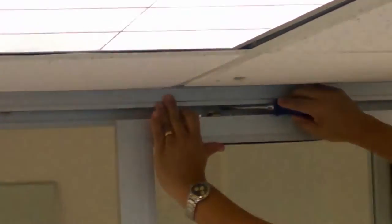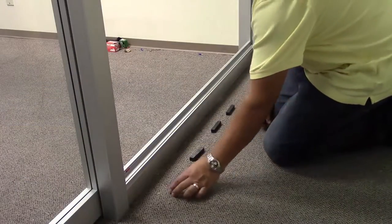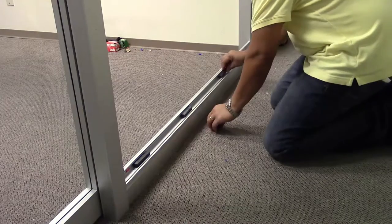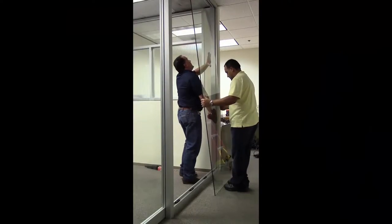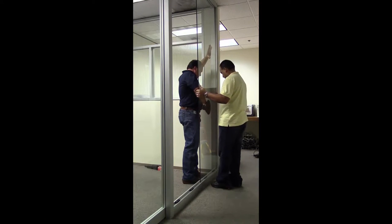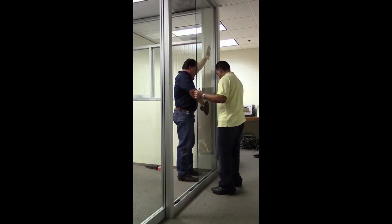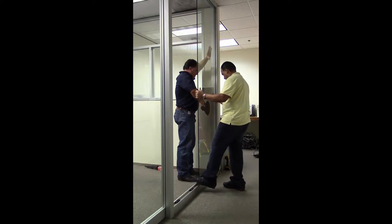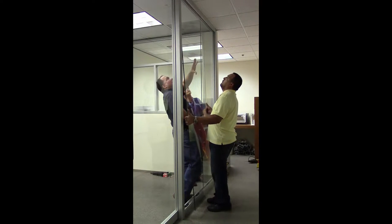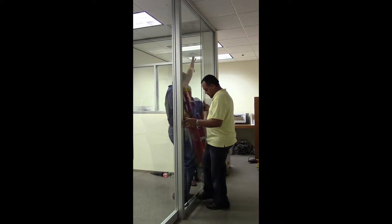The rollers allow you to raise or lower the door slightly with a turn of a wrench. To install the glass at the side light, first place glazing setting blocks on top of the glass base at each corner of the glass panel locations. If a butt glaze condition exists, begin with the panel nearest the outside glass jamb. Slide the top of glass into the header and place the bottom onto the glazing blocks. Then slide the glass as far into the glass jamb as possible. This will maximize the space to place the second glass panel. Follow the same step with the next panel and then center both glass panels.